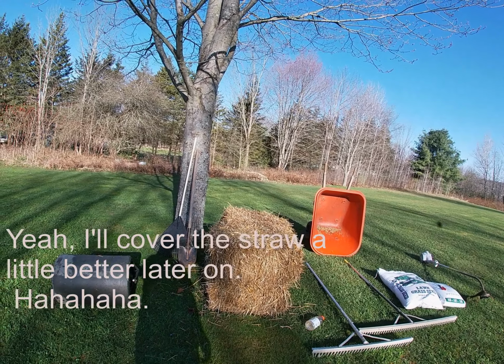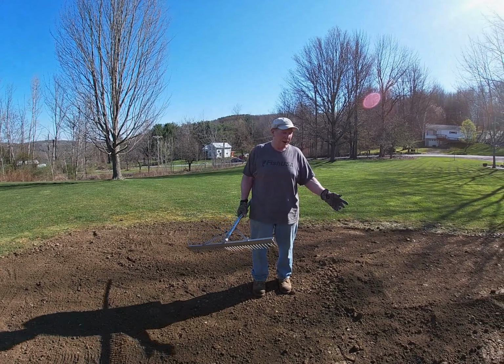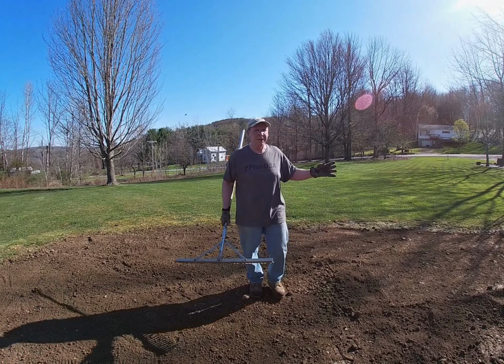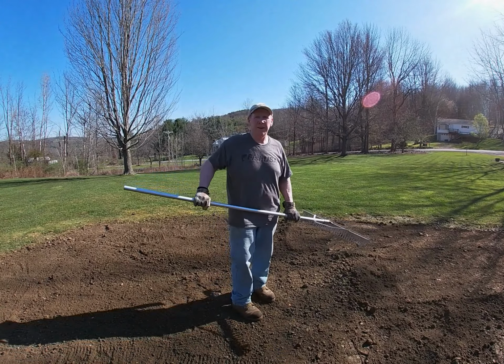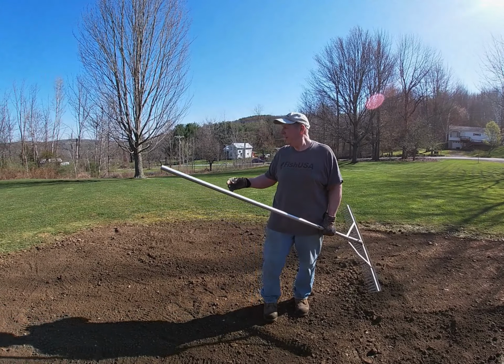All right, hard at work here. Jim's bringing the soil out, and when you're doing a job like this, you want your excavator to stay on the unworked part. Bring the soil out here where I'm working it down with the rake. He's getting a little ahead of me. Good excavator, drop it. He'll do the back dragging with a blade, and then I'll sit here and get the rough grade like I have here.